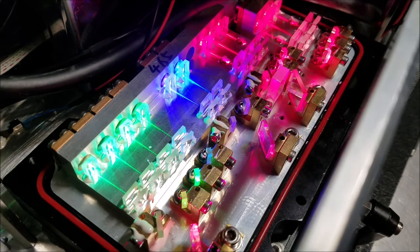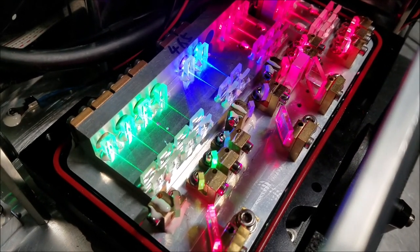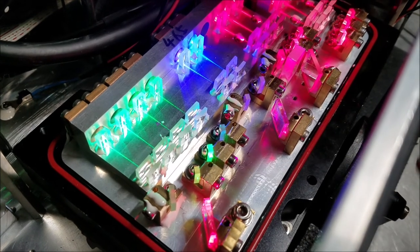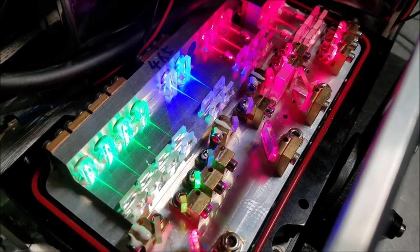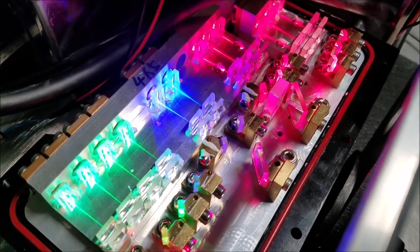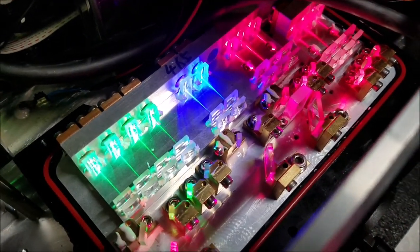The laser assembly and the optical mounts. Aside from the collimating lens setup that I don't like too much, the mounts are pretty okay. I don't have any complaints. The only difference, I would say, as far as improvements, is to change this to maybe a brass or just make aluminum mounts. That way, you don't get the thermal expansion coefficient differences and having those walk as much.